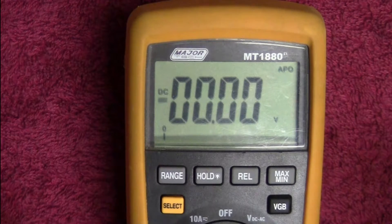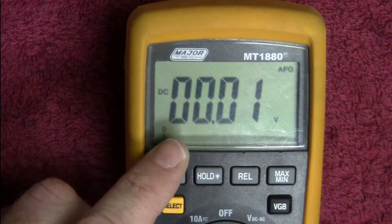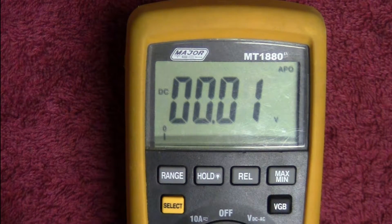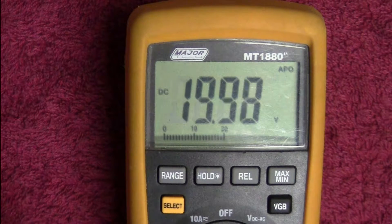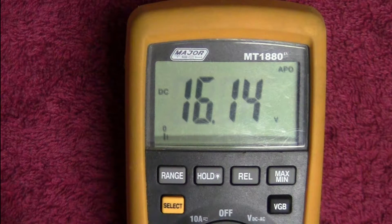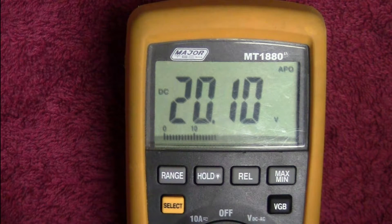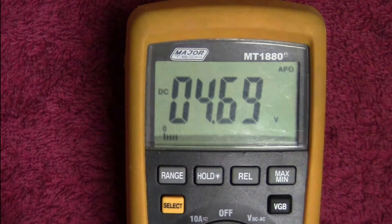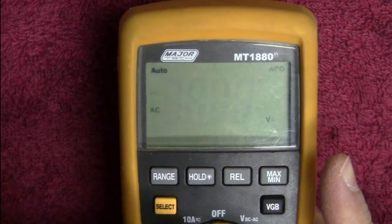Getting a bit closer with the camera — I'm going to throw 20 volts at this. One thing that's important to me when peaking a signal is the analog bar graph display. At 20 volts pulsed, the analog bar graph is almost immediate and then the digital display catches up. Every time I pulse it on and off you can see the digital display takes a while to catch up, but the analog bar is pretty constant and responds almost instantaneously. That's quite usable for peaking circuits.